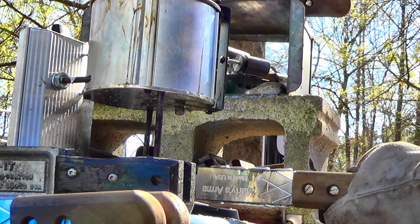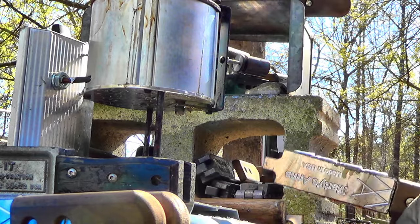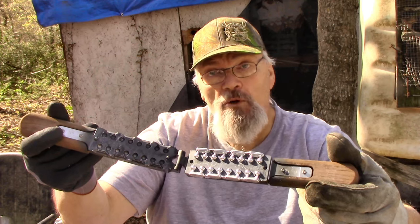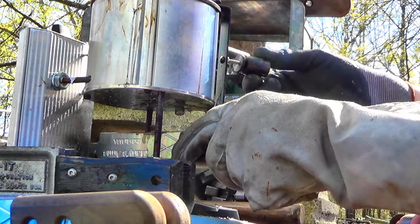So many factors can play in what the temperature of your alloy is hovering around. I keep my lead pot set on 8, 9. How your mold behaves, every mold can have a different personality. Unfortunately, that's just the way it is. One didn't completely fill, about 90 to 95% filled, but not quite. You could probably cut it off, tumble it, polish it, and it would be okay, but I'll throw those away. No, I don't throw them away. They go back in the sprue bucket to recycle back into the pot.